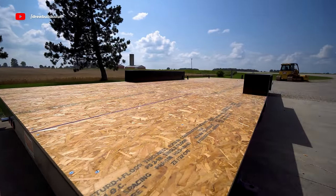Now before I install these rafters, I have to mark out the placement, so I'm just marking out the ridge beam every 2 feet on center. And I'm putting the tick 3/4 inch offset so that the center of the board will be right on the 2 foot mark. And same thing with the top plate. Now I can just start installing all of my pre-cut rafters.